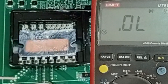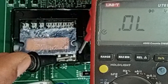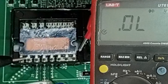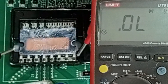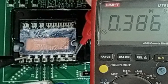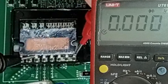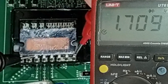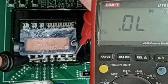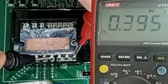Now it's time to test the IPM and let's see what issue might be present in it. These three pins are the negative pins of the IPM, followed by the W, V, and U pins, and then the positive pin of the IPM. I have connected the multimeter probes to the positive and negative pins for testing — the voltage drop on these pins is showing perfectly fine. However, the U pin is showing 0 voltage drop. Checking the V pin shows the voltage drop is fine, and the W pin voltage drop is also fine.